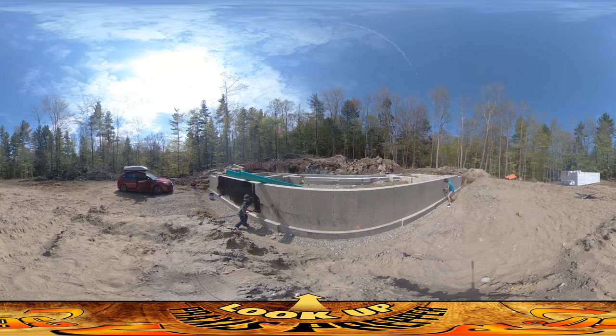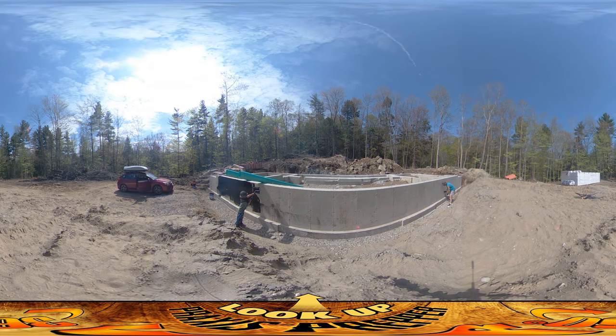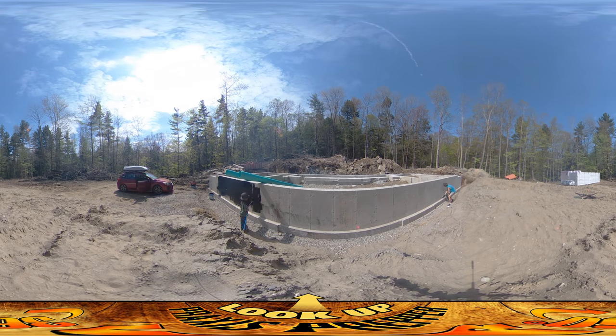I ordered about a hundred sheets of this four by eight foam, and that's going to cover the whole face here. It's going to go all around the backside and it's going to be down on the inside underneath the slab to try to retain some of the heat from the house. With the wood stove burning in the wintertime, it'll help to retain some of that heat.